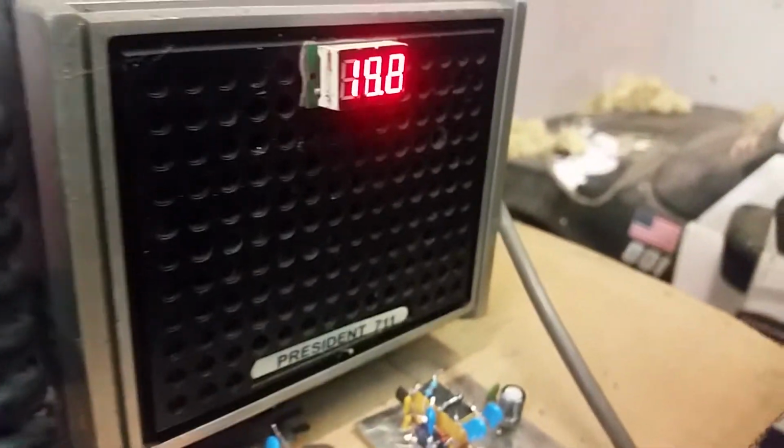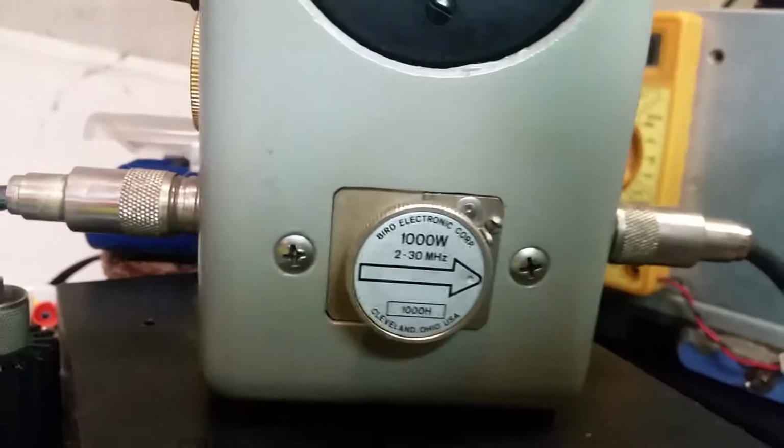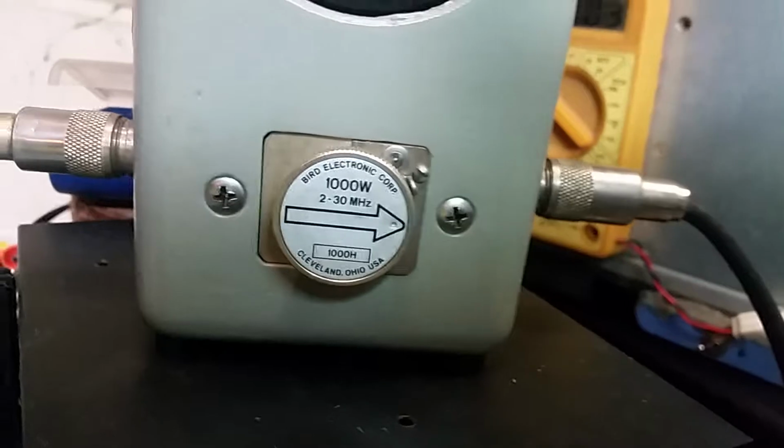Dude, yeah, she's already hitting about 800 watts. Voltage drop, dude, 13.6 volts. See, it's pushing it down pretty good. All right, so I'm going to reach back here and flip it on the high tap. I'll hit it real quick with the bench radio RMS, then I'll hook up the hot radio to give it a little more drive. All right, we're on the high tap now.